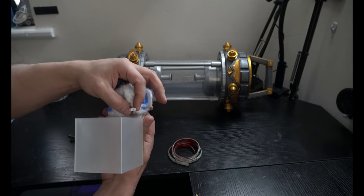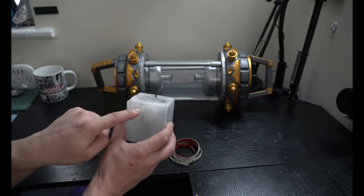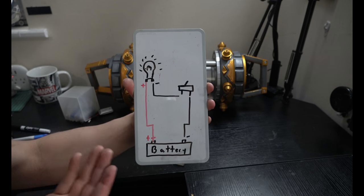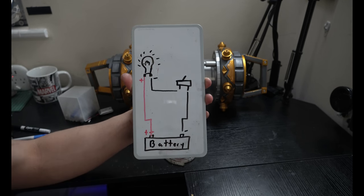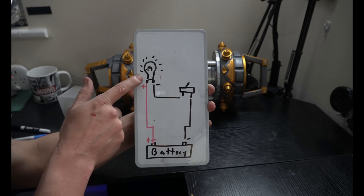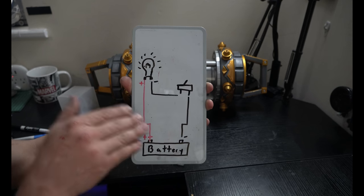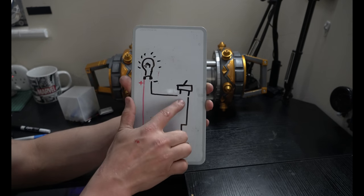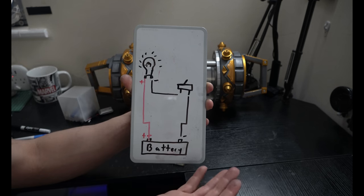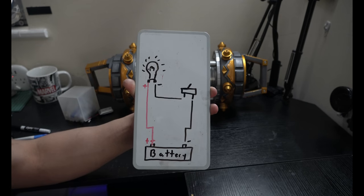I even left the charger hanging right here so I can recharge the Tesseract without taking everything apart, and I use a very simple piece of clear tape as a hinge so I can open everything up. The basic wiring diagram: positive goes to the positive side of the LED, and you're only interrupting the negative with a little switch. You can replace this with a reed switch or almost anything — you just need a way to turn it on and off, then it follows back to the negative of the battery. A very simple circuit.